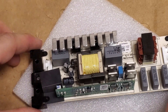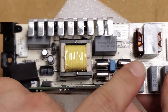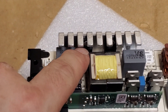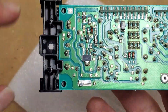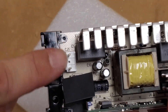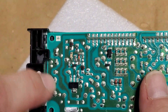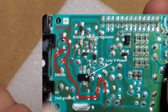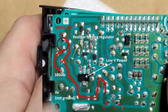That short circuit can be in a few places. It can be on the actual output MOSFETs here, or more commonly I see it on the input MOSFET — the primary switching MOSFET, I'll call it. The power comes in through here and once it's coming in, it goes through a coil, an inductor right here marked with a 680.